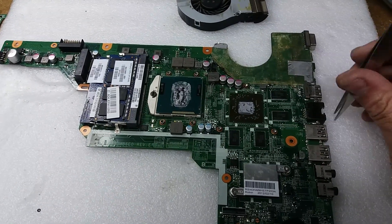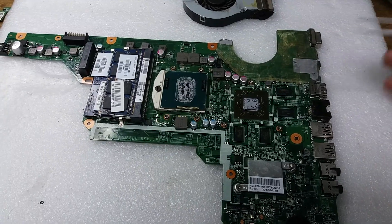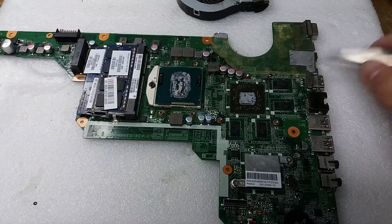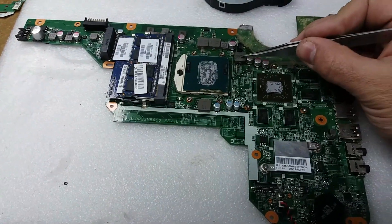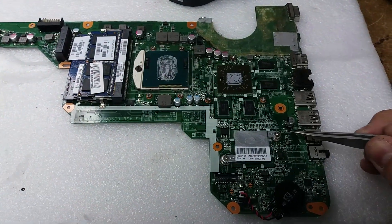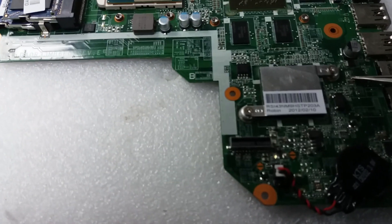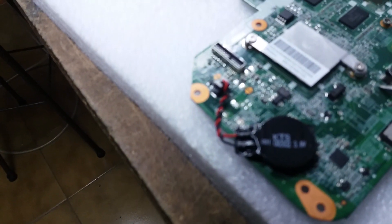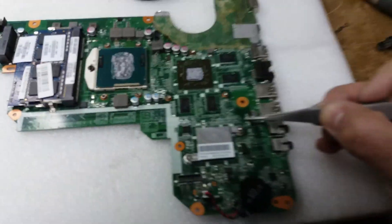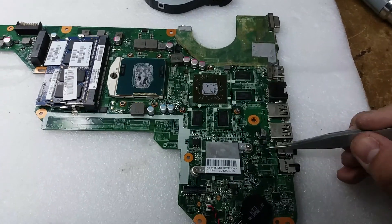On top of the surfaces that were not clean. Now this is your graphics chip, and the fix I'm going to show you is a hundred percent doable — there's no problem. You don't have to reflow, you don't have to reball, you don't have to do anything. You just need a soldering station. You're going to do two things: take off this coil over here, and change this resistor which is R550, and put it on the space that says R549. That's like a jumper setting — I'll link a few pictures for you to see as well. Let's get started.